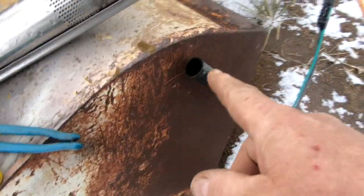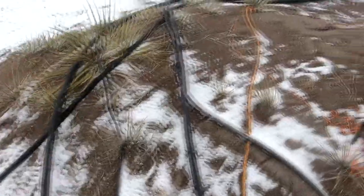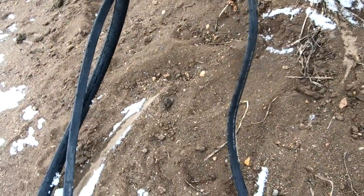Here's the original poly pipe, which is approved for this application, and the cord that operates the pump and a strain relief rope all running along here. It was about at maybe 35 feet — not 20. At 35 feet, we were pressuring up some water through this and we found a hole.